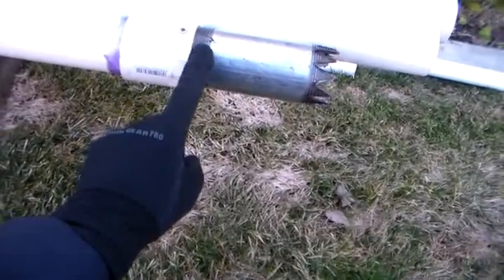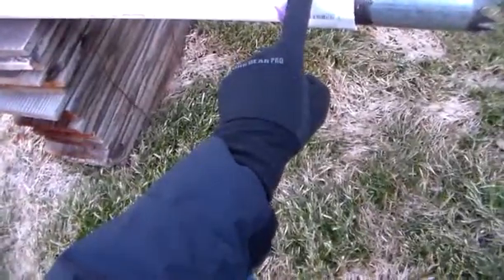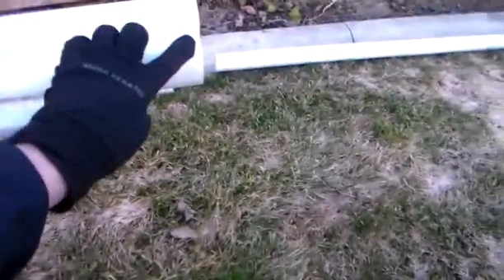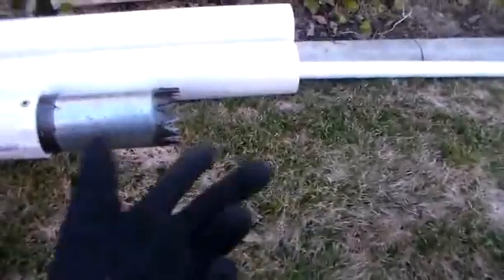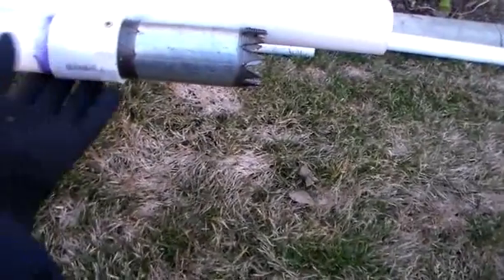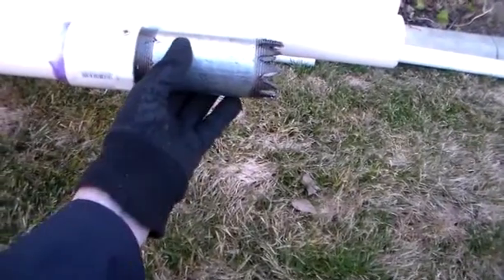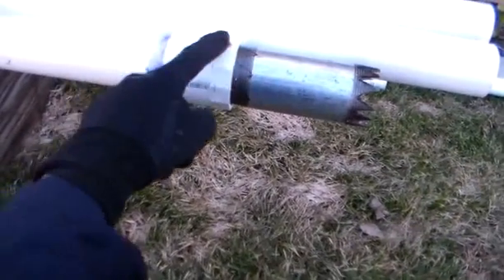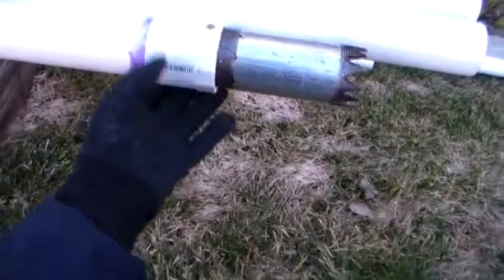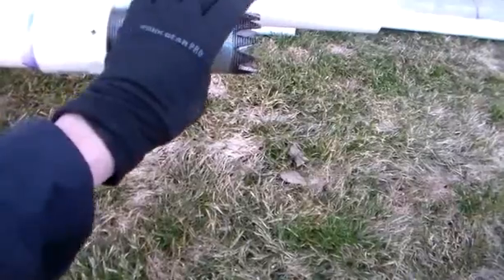You can actually just not even use a metal drill bit — you could just make sawtooth cuts into these pipes. I wanted to be able to re-use this, so it's not glued in, just the coupling. You want to put at least one screw in — I put in two — so that as you twist back and forth, that thing's not going to twist off and fall out. You also don't want the screws to over-penetrate the inside of your drill bit, because you're going to be dropping this piece of pipe down in there with a well screen, and it also has outside couplers. You just don't want it to get hung up on anything like the well screen.